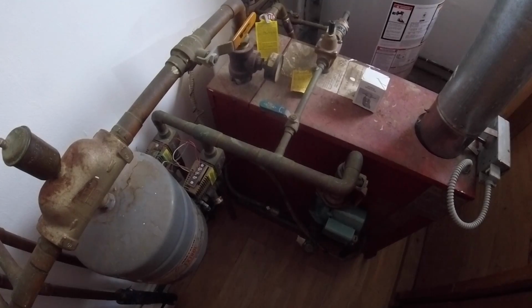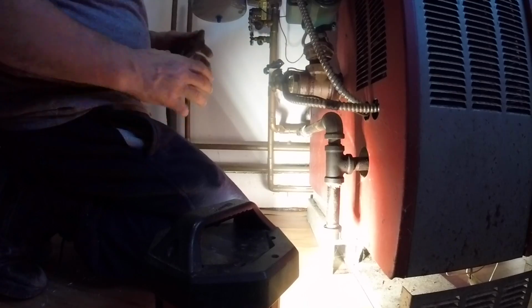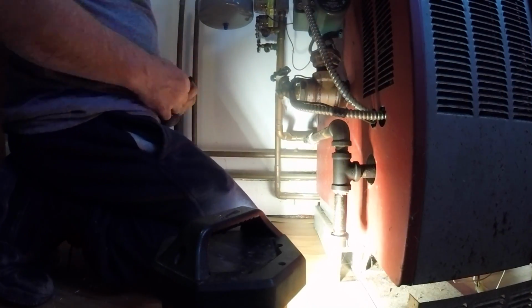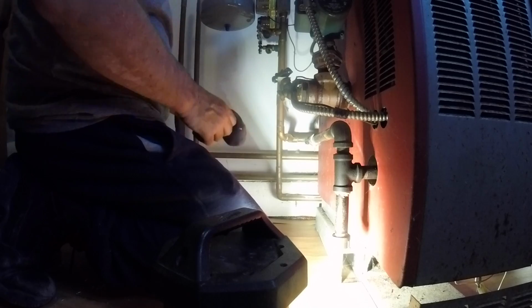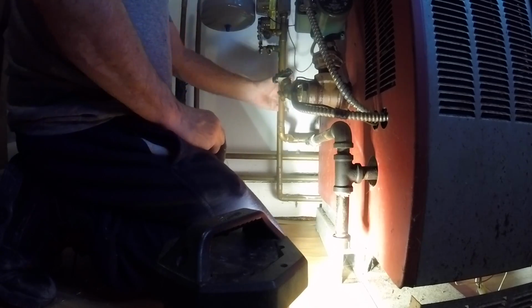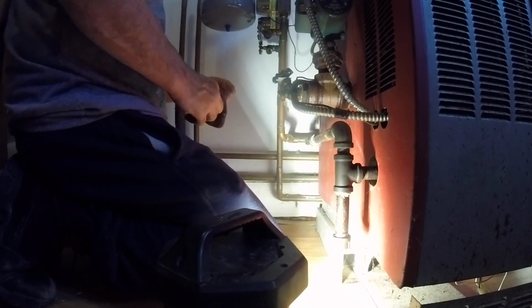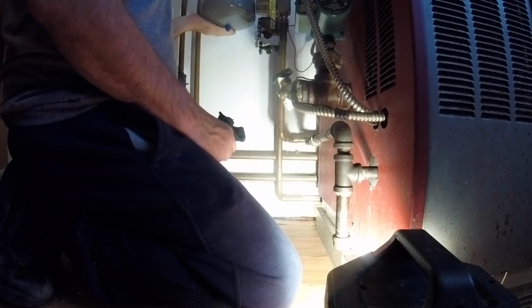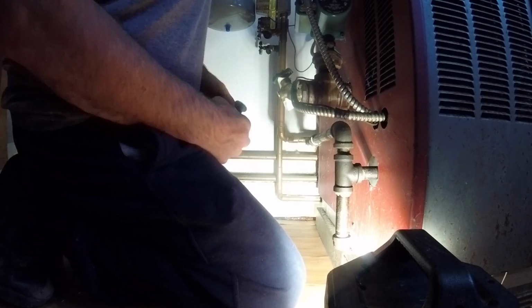It sounds like to me everything's fixed. Oh, I like that. Well, the wife would like that too. Well, I'll tell you what, these returns are coming back super hot. Yeah, they are. All right, so they're heating, they're circulating good. New pump. This is the one that's on. This one's not. That one's on auto, so it will operate. Because for some reason, when you turn it back and you let it sit, it won't kick on and heat the upstairs. Oh, what happens now? It won't heat the upstairs. Which one? The back one, because it's on auto.